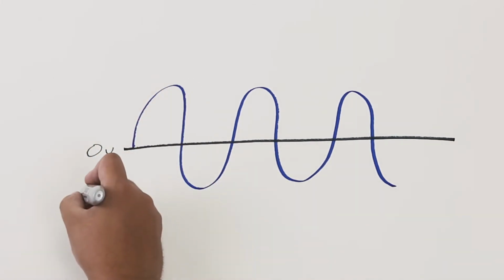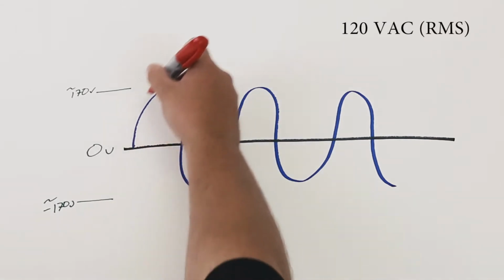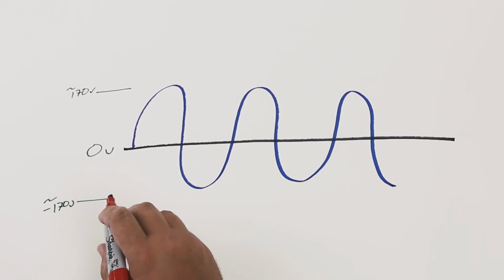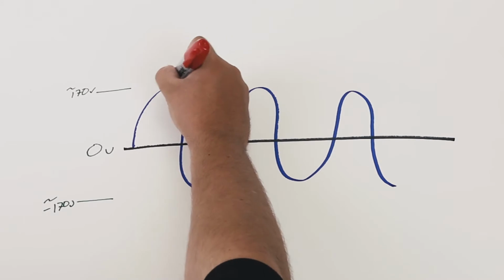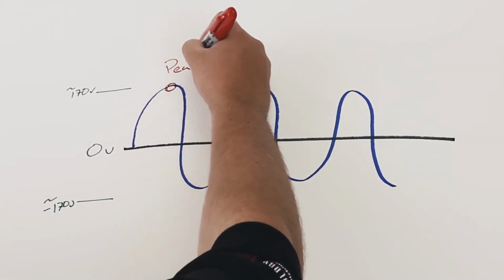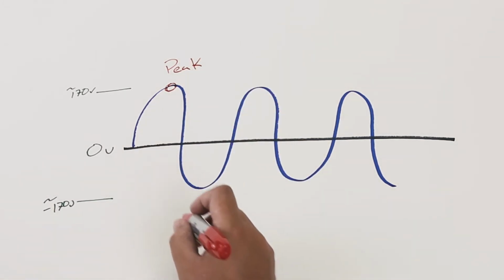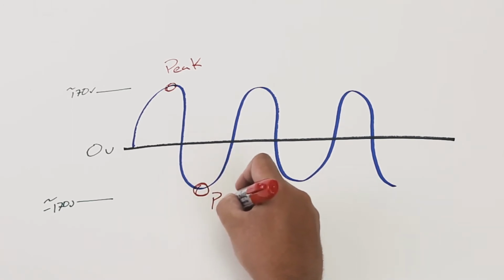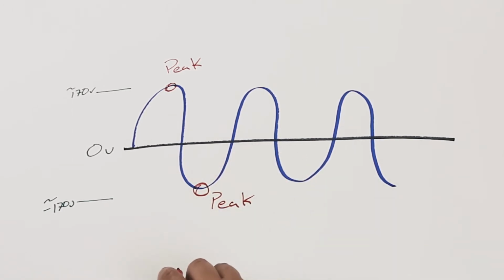The AC voltage is shown here as amplitude or deviation from zero. The AC wave is sinusoidal, or a sine wave, meaning that the waveform has a smooth repeatable oscillation. Switching at the peak of this waveform will result in a large inrush of current because the capacitors found on the input of LED fixtures in a discharged state initially act as a short circuit. This inrush ultimately causes the relay contacts to arc and deteriorate before eventually welding closed, causing day burners and added stress to the driver circuitry.